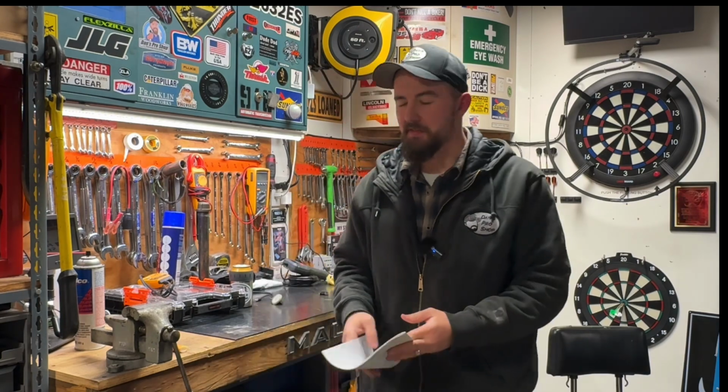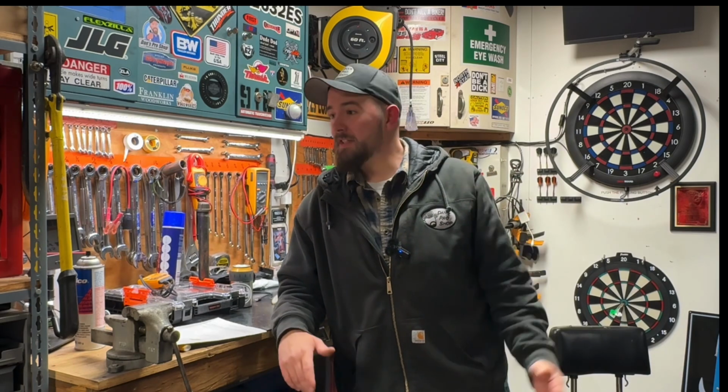And you know, that just comes from doing stuff like this, doing diagnostics and trouble trees and everything. And since I was bouncing back and forth between those 3 different codes, I read through the trouble tree on those 3 codes and found the common denominator, if that makes any sense. So the one most likely cause in those 3 codes that overlapped that might be the most likely culprit, that sensor on the exhaust, that proof of flame, the POF, to make sure that that thing actually sparked up after start.